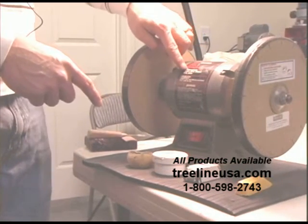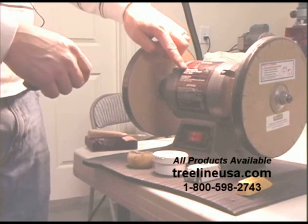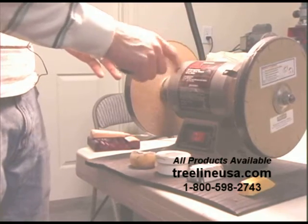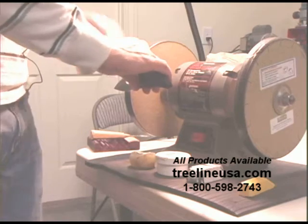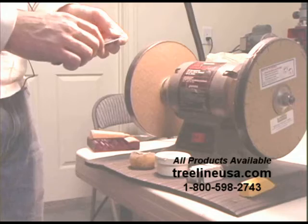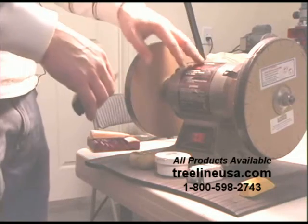You can use a 5-inch, 6-inch, or even an 8-inch grinder as you need, but I do recommend that you have the wheels bigger than the grinder. That way, when you're pulling the knife across, you're not bumping into the motor with your hands. So give that extra clearance — it gives you a little more flexibility on working around the grinder.